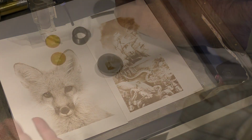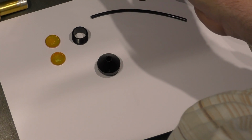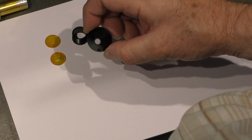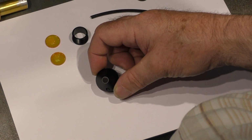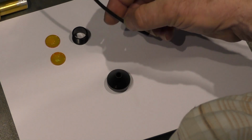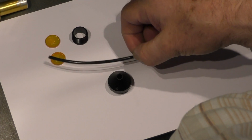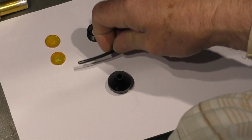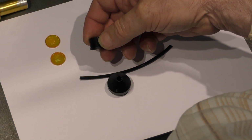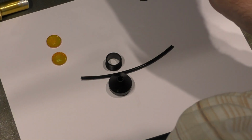This is what we're going to demonstrate to you today, how I got to this picture. Wasn't difficult at all. So when you order a universal nozzle assembly, here's what you're going to get. You're going to get a nozzle which has got a 6mm hole in the end, and it will have a 3.8mm hole in the side, and you will be supplied with probably something like about a 6-inch piece of 4mm diameter polyurethane pipe. And this piece comes with it as well, which is its clamp ring. That's what you get if you just order the universal engraving nozzle.